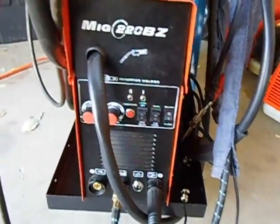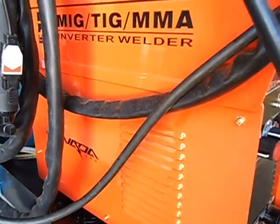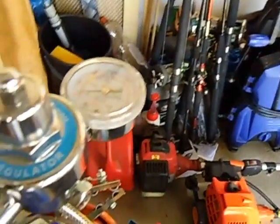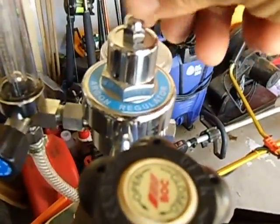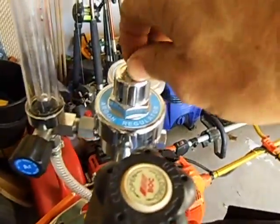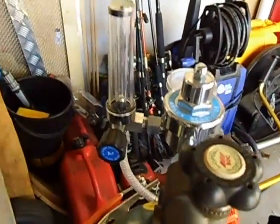There's the 3-in-1 machine, which is Chinese-made - a Nevada Pro inverter welder. I've also got my argon cylinder here with a flow regulator plus a main gauge to show how much pressure is in the tank. To set the argon regulator, you can take the cap nut off and there's an allen key bolt so you can adjust it up or down to get more flow if your flow doesn't go high enough. Then just put your cap back on to lock it, and adjust your flow up or down so the ball goes up or down to get the right flow.